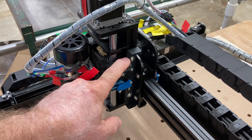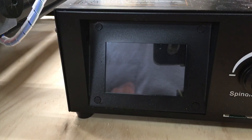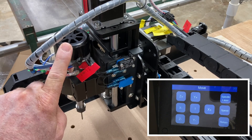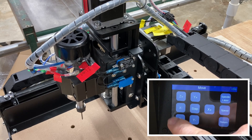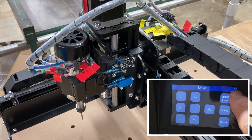So if you accidentally hit one of these and it turns off the machine, how do you fix it? How do you turn the machine back on? So I'm going to go ahead and turn this machine on. We've tripped this and it stopped the machine from being able to go up any higher. Over here, you'll notice the little question marks. So what we need to do is hit return, reset the machine, and then unlock it. From there, we can go to move. If I just push the button to go lower, it's not going to do anything — we have to hit step. We'll bring this back to one millimeter and go down. You can see it move just a tiny little bit, but the question marks came back again.